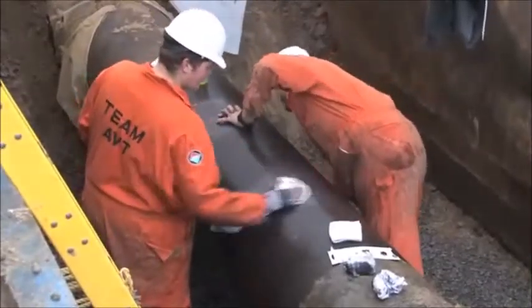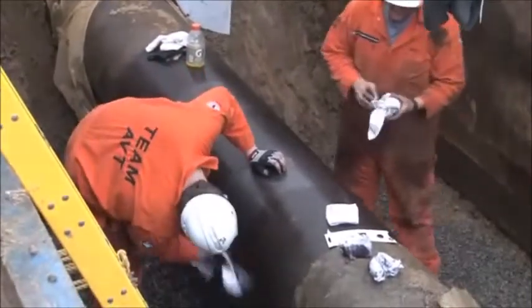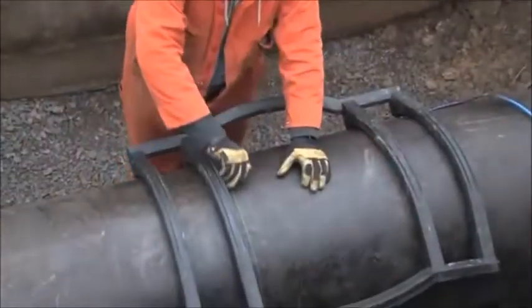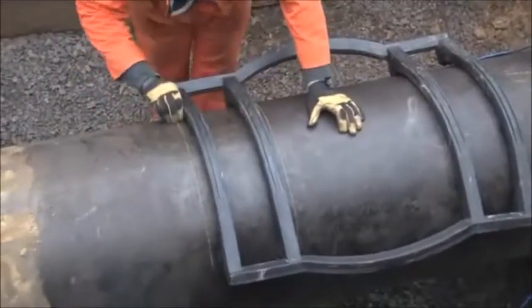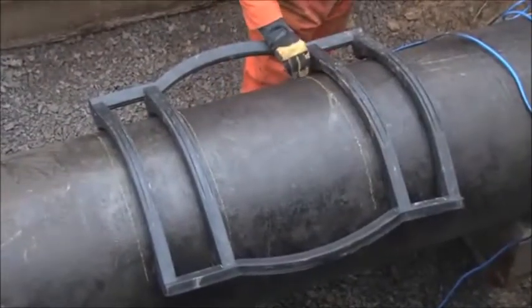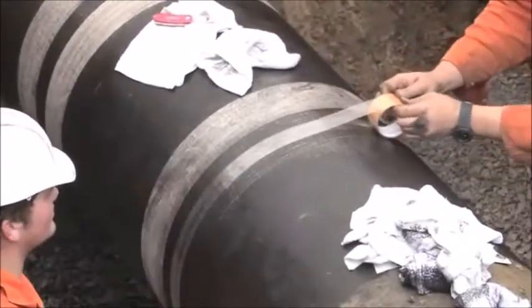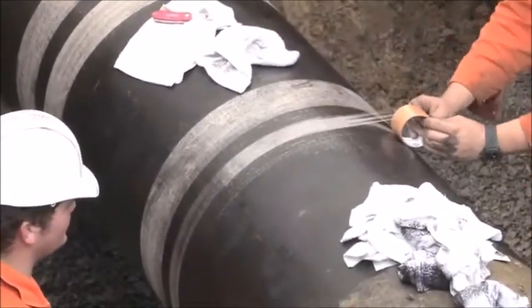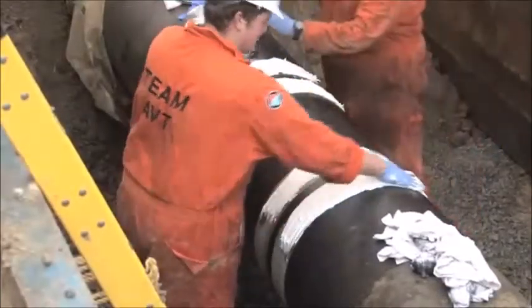Here's an actual 24-inch EZ2 installation. The pipe is thoroughly cleaned and prepared for the installation. The housing gasket is laid out on top and used as a template to mark the locations for the placement of the anti-friction tape, which allows for the ease of rotation of the valve body. The tape is wrapped around the pipe — we recommend 4 wraps.